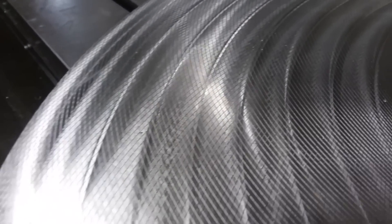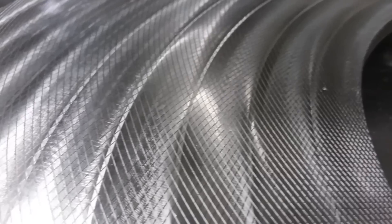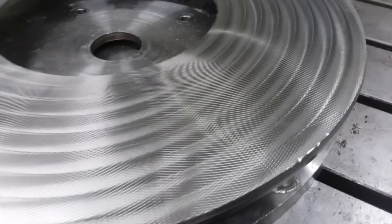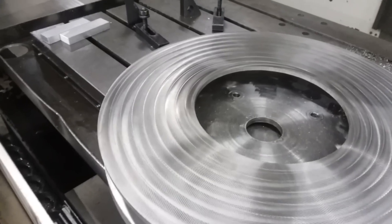Using that boring bar, boring head, and fly cutter, you can really see the difference between the diamonds here and here, and that is how you give yourself a texture across the entire surface. To run that only took three minutes — yeah, just three minutes. You can't beat that as far as the time is concerned.